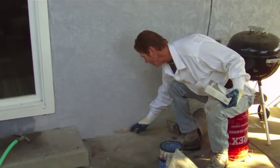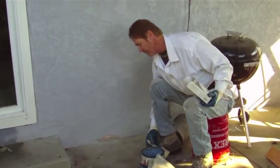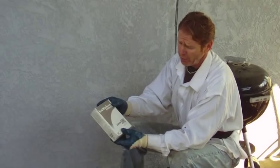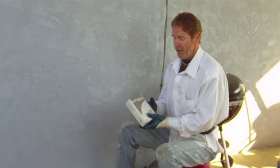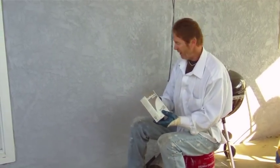So we have a holiday that appeared on this 10-year-old color coat. What I'm going to do is hit it with a little Weld-Crete bonding agent and mix this up. This is a La Habra stucco color patch kit — about five bucks, you can order them. La Habra started doing color coats around 1926, Western started around 1932, then you have Omega and a whole bunch of others.